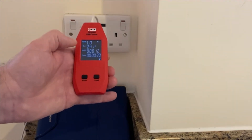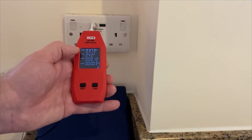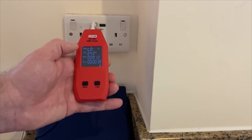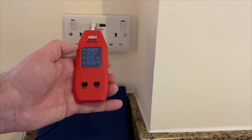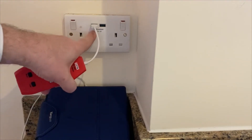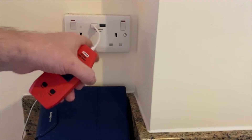Push the button again to simulate 3 amps and we can see that the illumination goes right down, telling us that the voltage is low at 3.7 volts. So 3 amps has dragged the voltage right down. Just to confirm, this is a 2.1 amp USB charger outlet rated at 5 volts, so 3 amps exceeds its capacity.